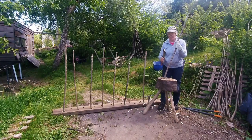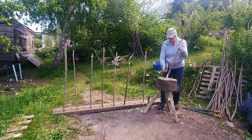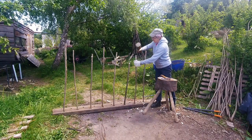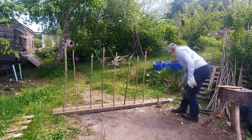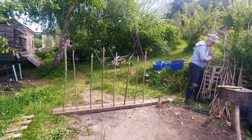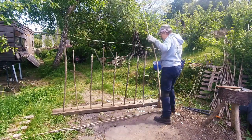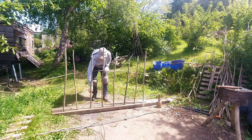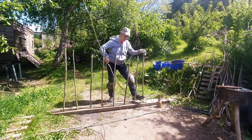Now I put a point on the hazel rod and insert it into the former, and then we start weaving the panel with the hazel rods. To start with we have two hazel rods — these are fairly thin because we're not going to cleave them — facing in opposite directions. This is a different pattern from the rest of the weaving in that it forms a sort of cross between each upright, rather like cross stitch. This is called pair weave.